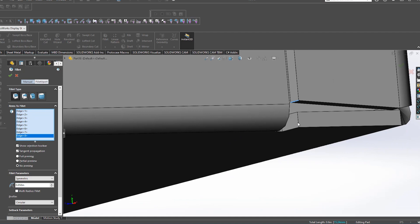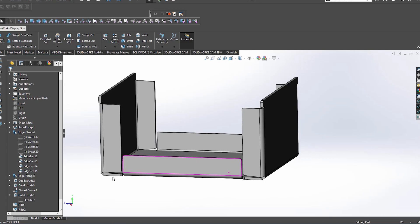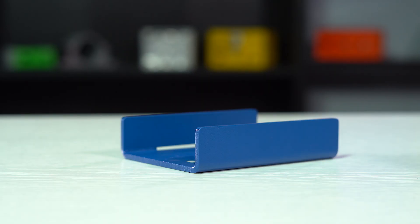Our engineering and design services team will always add small fillets to any sharp corners on a part. We add fillets in the radius range of 50 thousandths of an inch. We found in all of our testing that this is the ideal value to not affect the aesthetics of the part too much, but will round over those corners to help prevent anybody on our production team, or yours, from injuring themselves while handling these parts.